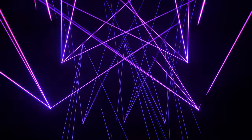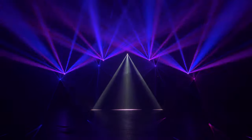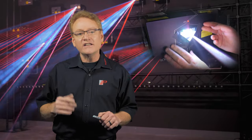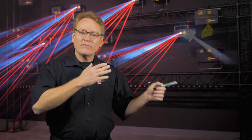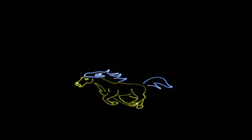The problem is the razor-sharp beam gives you only one tool to work with — it's like this Sharpie. Beam effects are restricted to rods of light and sheets of light, and a combination of the two. With audience scanning, you bring these rods and sheets of light and point them down into the audience, but to ensure safety, lenses must be used. These lenses distort the laser beam and they often must be mounted and adjusted on-site, sometimes up on a truss. And laser graphics are restricted to simple cartoon line images with no ability to color in broad areas.